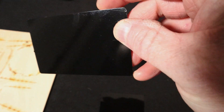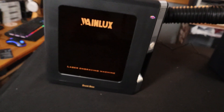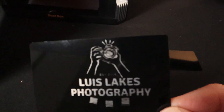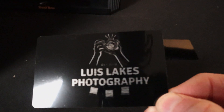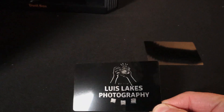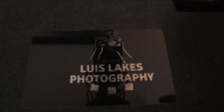I'm going to engrave one of these acrylic-looking business cards and see how it appears — that'll be the last test for this video. Here it is. A little bit off center, but engraved really well in the acrylic. Remember, the diode laser can only do really dark colored acrylic — it cannot cut through or engrave clear acrylics. That's just an alignment issue, and the engraving came out really nice.